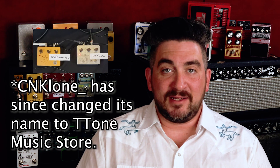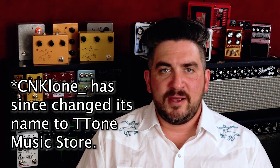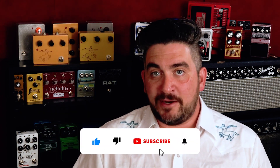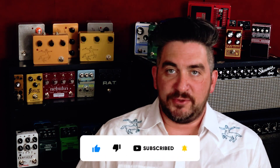And despite the right one being so damn good, the wrong ones are also really not good. I figured out that certain shops sold the right variation. I was dead sure that if you bought from US Dream 2016, you'd get a Klon Clone nearly a dead ringer for the original. But if you bought from CN Clone, you'd likely get one where the treble knob didn't work correctly — it only turned your treble down, whereas a true Klon treble knob boosts your treble.